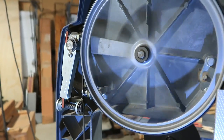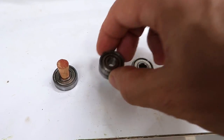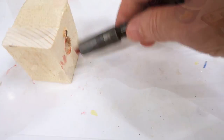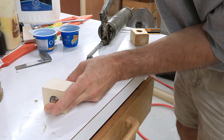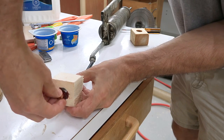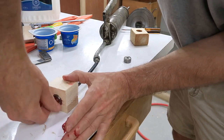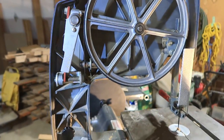I'm pretty sure this bearing is now quiet, but there's another thrust bearing up here, and that's making lots of noise. Shopsmith bandsaws are weird. I just washed out the other thrust bearings in this bandsaw, and this time I'm gonna try to pump the grease through by putting that in here, and then this fits onto the grease pump. Look at that grease coming through — excellent. I'll just spin that a bit to make sure the grease gets spread around. Yeah, that's a lot quicker than the vacuum cleaner. And now the next one.